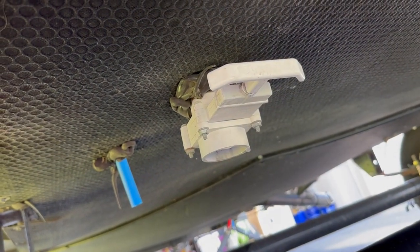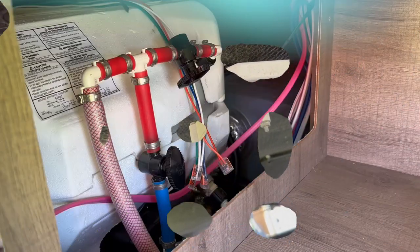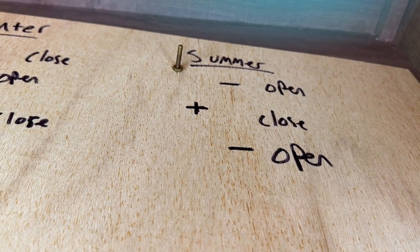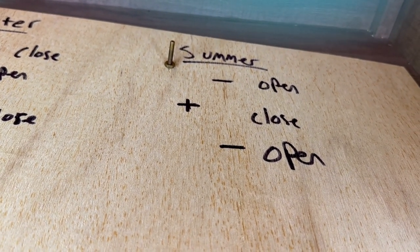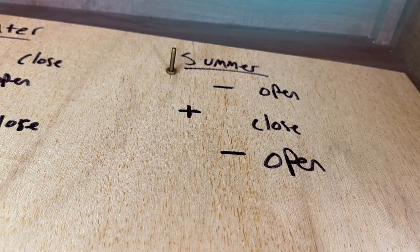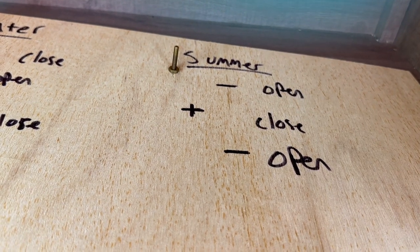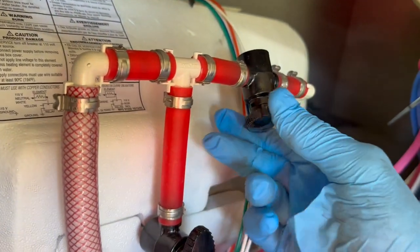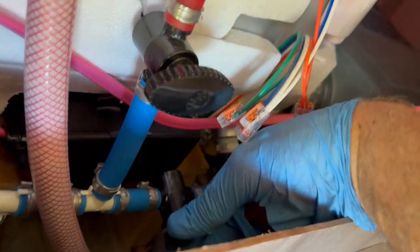Water's draining. Let's shut that valve off. No leaks — we're good to go there. Let's go ahead and look at our cheat sheet and double check. Summer is open on top, closed in the middle, and open on bottom. Always remember that open means the lever will be parallel with the water line, and closed means it's perpendicular. So let's turn these on and off in the right order: top one's on, middle one's closed, and bottom one is on. It's going to look just like that top one. And we're done — we can put our access panel back on now.